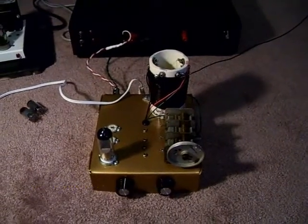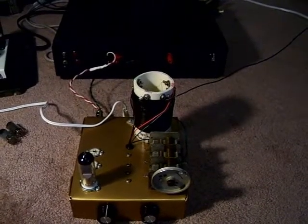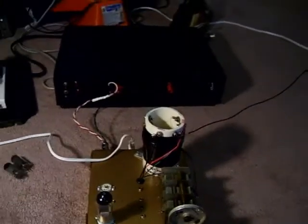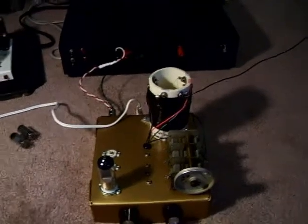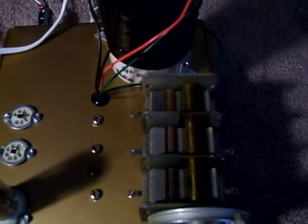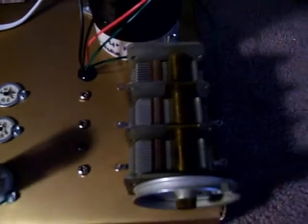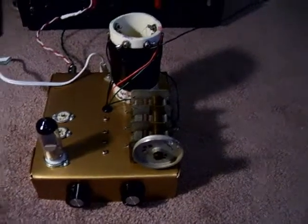This is my radio chassis. I had some sheet metal workers make it for me. The tube you see there is the radio coil. I wound wire on a PVC pipe that's 2 inches inner diameter; the outer diameter works out to be maybe 2 and a quarter inches or somewhere in that neighborhood. The capacitor has three gangs — I salvaged it from an old All-American 5 radio that I got at a flea market. The back plates are the oscillator plates, and the front two are for tuning, probably a TRF-type configuration on the front end.